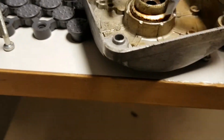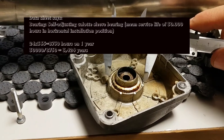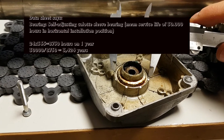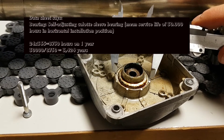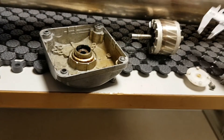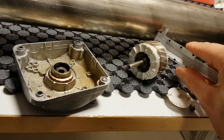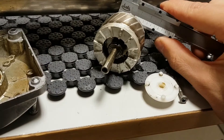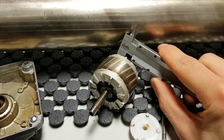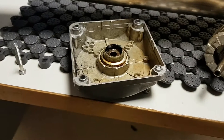The dimension is about 29 or 30 — something like that, 29, 30, 31. And the shaft is 6 millimeters. So you want a ball bearing with 6 millimeter inside and about 30 wide.